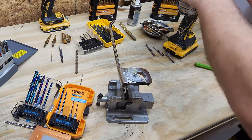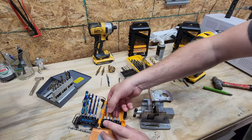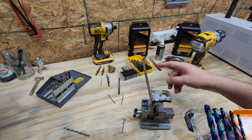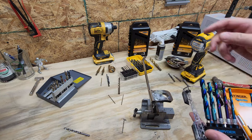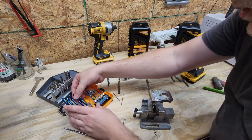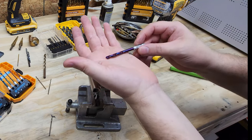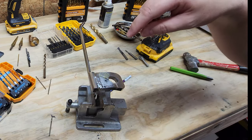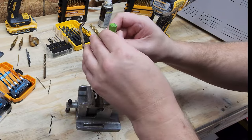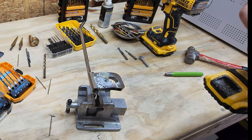Let's try a much more difficult drill bit. These kits are called an index — so when you say drill bit set, it's a drill bit index. Let's go up quite a bit in size — this one here is 7/32nds. Normally I would pilot a 7/32nds hole but let's see how this little bad boy can handle it if I just go ahead and center punch a hole. I'm going to use the impact driver. If it breaks, it breaks.